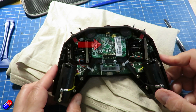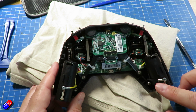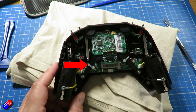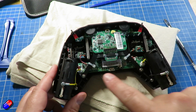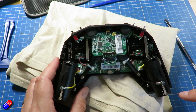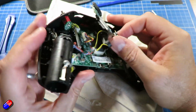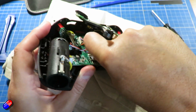Now the RF board here is the one at the top that we can look at, and under there is the little battery that we need to replace. So we need to move it. I would clip off the little cable tie in the bottom left hand side, and that will allow us to pick it up. So we need to take off these 2 screws at the bottom, and then we can gently maneuver the entire piece out of the way without having to remove the antenna cable. Now with those 2 pieces done, you can just gently wiggle it out.